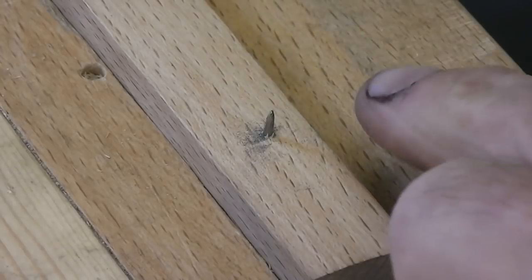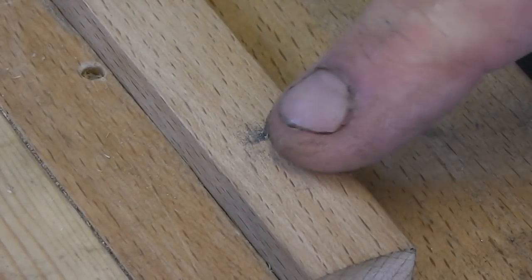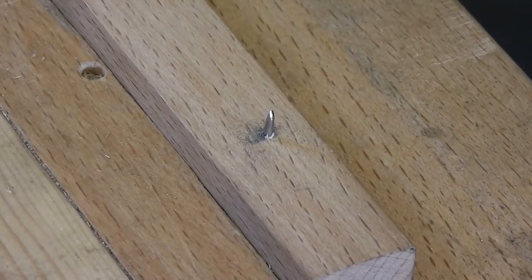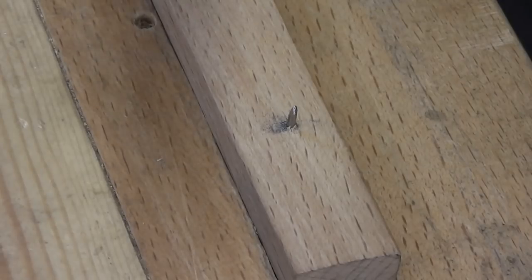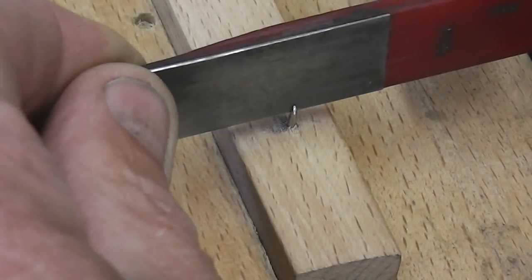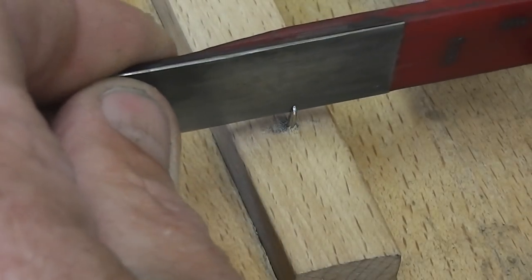What I'm looking for is a little rounding at the top and a curve around that way, with a flat on the other side as discussed. I've got a fine diamond slipstone which I can use to just polish up the faces I've created — there might be a little roughness left from the file. I'm just giving them a light tickle to polish them up. It's probably not absolutely necessary if you haven't got one, but it does give a slightly cleaner cut when using the gauge.